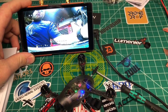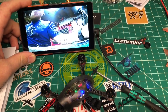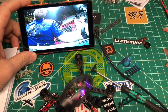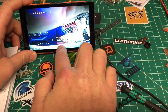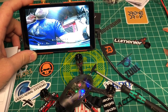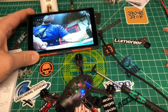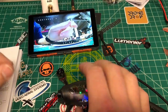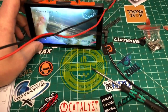We've got voltage and amps, though the amp reading doesn't look correct — it says 17 and didn't really move, so we're gonna have to calibrate that. Fly time, voltage, and name are up top, RSSI is there. Kind of a bummer I couldn't find fly mode, but overall the OSD looks pretty good. Camera looks good too.